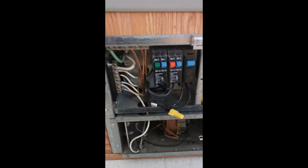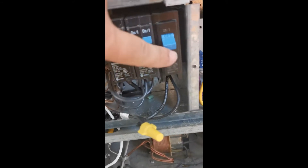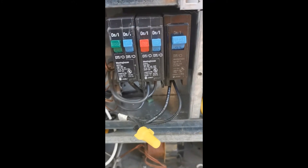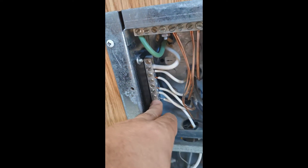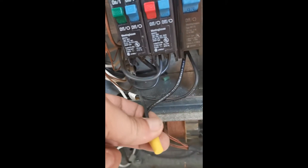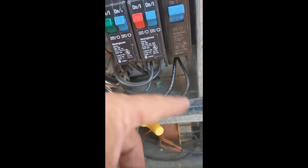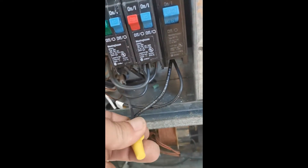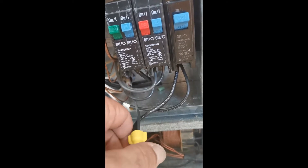We've got the AC portion off. This is our control breaker right here. My AC is off in the garage — I've got a 30-amp wire to this thing. Here's your neutral going to your bus bar. This breaker has two feeds: the converter is going directly to the breaker, and a ground fault circuit for the camper is powered off of that breaker.